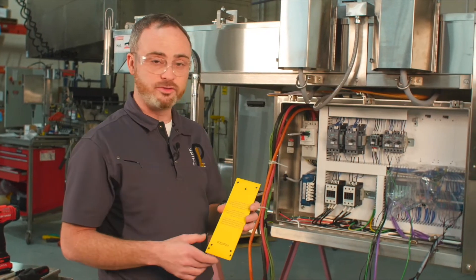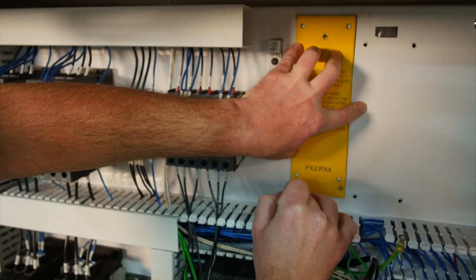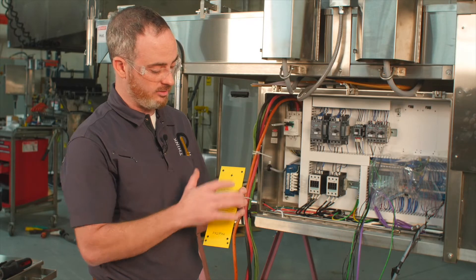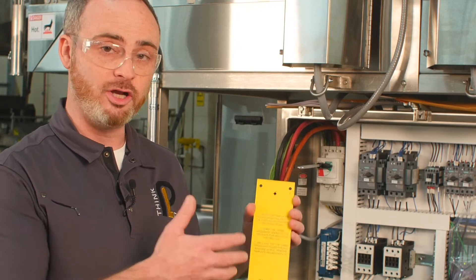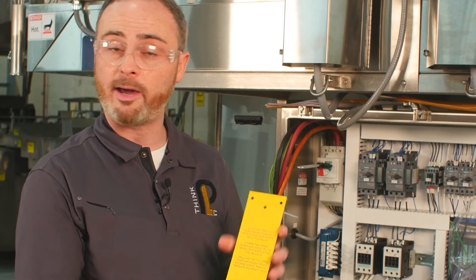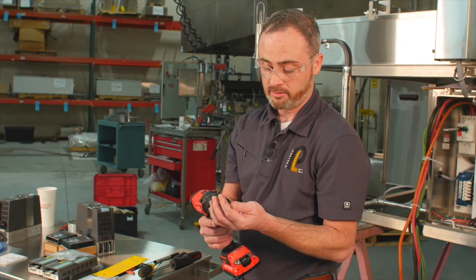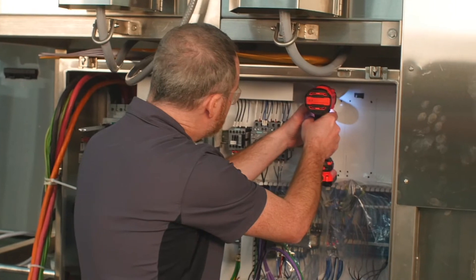When you used the Sharpie on the template, you indicated the top hole and the two bottom holes with crosshairs — those are what you need to drill. The holes without crosshairs are the original bolt pattern for the MicroMaster drive. If you line the four holes up to the original bolt hole pattern, that gives a new indication for realignment. Using low speed on the drill to hold the tap, power-tap at lower torque to create the machine screw fitting.